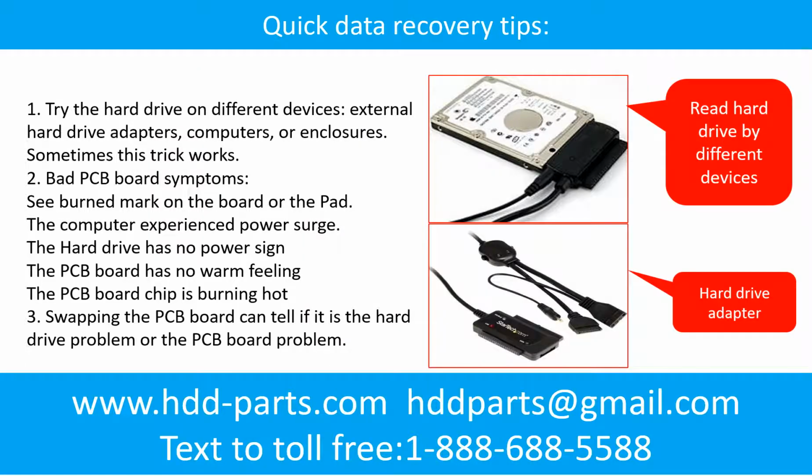There are some simple ways to recover data from a hard drive. One of them is to try to read the hard drive with different devices, like different external hard drive adapters, computers, or enclosures. Because different devices use different ways to read a hard drive, sometimes this trick works. Another way is swapping the hardware PCB board. Swapping the hard drive PCB board can fix the problem caused by the PCB board. There is a cost in swapping the PCB board, but it is way cheaper than sending the hard drive to a data recovery firm.